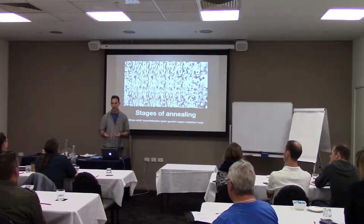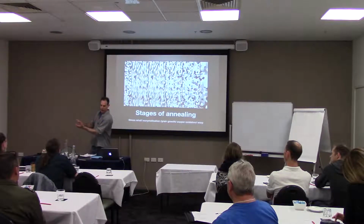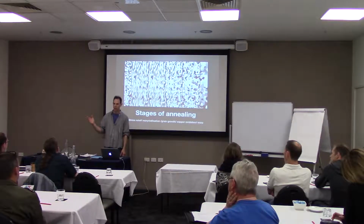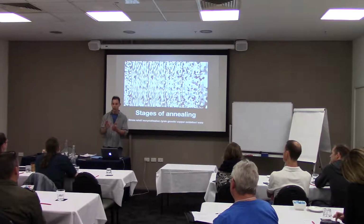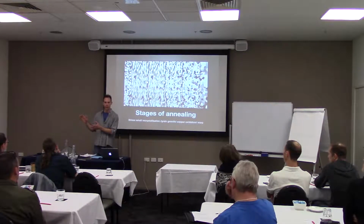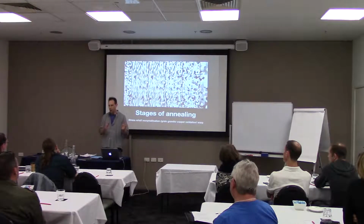And it turned out to be really hard to do, because as you spin a bell, the throat is getting spun and then spun again and spun again closer to that flare. By the time you get to the end, it may have only been spun a couple times, like in that flare, but that throat has been spun every time. So the more you work harden it, the more stress has been created on all those grains, the higher the grain count is going to be in that area, and the lower the grain count is going to be at the end of the flare. So what he wanted to do was try to even that out.